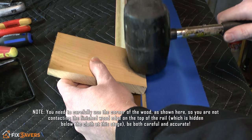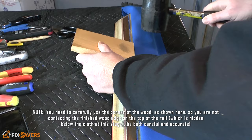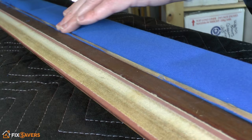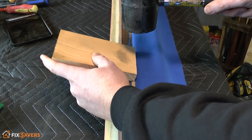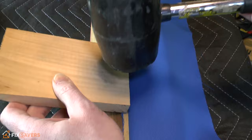Give it a little tap using the corner of the wood, doing about half the width of the block at a time — a nice firm tap to get the feather strip sunk down nice and low for a solid lock on the cloth. Feel along the feather strip to check how indented it is — you want it even all the way along. If you feel any areas where it's a little bit higher, go back and give that area an extra tap. Run your finger over it, make sure it feels level and good, then move on.